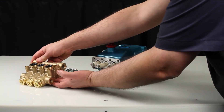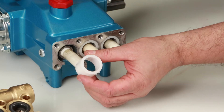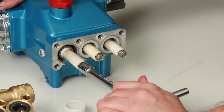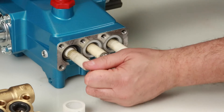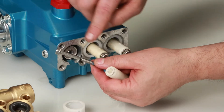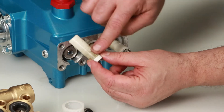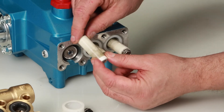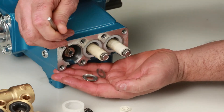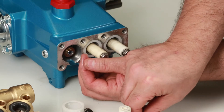Before reinstalling the manifold, be sure to replace the plunger retainer gasket included in the seal kit. Begin by removing the seal retainer. The seal retainer has two holes, one of which has a tab that is installed facing down into the slot of the crankcase. Using a 10mm wrench, loosen and remove the plunger retainer and plunger. Inspect the plunger retainer gasket for nicks or tears, then inspect the ceramic plunger for cracks or scoring to the surface. Remove the keyhole washer and barrier slinger located behind the plunger. Both parts serve as a barrier to prevent water from entering the crankcase.